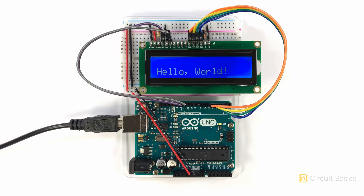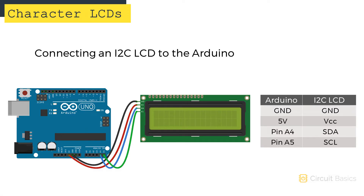There's a lot more you can do with this library — it has functions for scrolling text, printing custom characters, clearing the display, blinking text, and more. But since I2C LCDs are going to be the best choice for most projects, let's look at how to use I2C LCD displays. I2C LCDs only use two data pins, so wiring to the Arduino is pretty easy. GND connects to GND, VCC connects to 5V. On the Arduino Uno, the SDA pin is pin A4 and the SCL pin is pin A5. If you're using a different Arduino, just connect SDA to SDA and SCL to SCL.